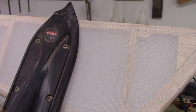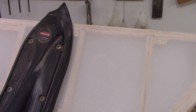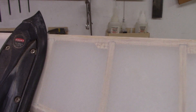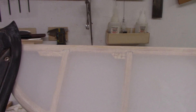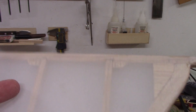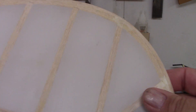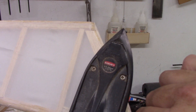If I've just got a couple of little spots with a little pucker — I'll show you on the rudder, I've got a little bit of a pucker in there — what I want to do is up the temperature and see if I can get that little pucker out, because it's not in a spot where it's going to tweak the shape. That is all done, and you don't have that noise that you get when you put the nitrate dope on and it locks all the weave together. Let's go ahead and crank this side out.